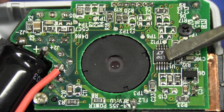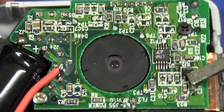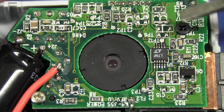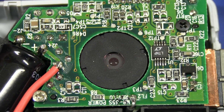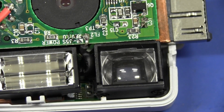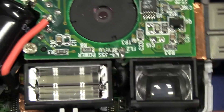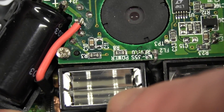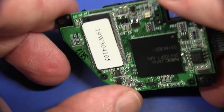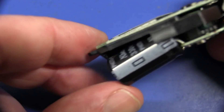The main board is pretty simplistic — that looks like a Linear Technology logo there. I don't actually know what the part is. We've got SOT23 devices, passives, and not much else in here at all. So we'll flip this over — here's the lens obviously for the CCD sensor, and we've got the viewfinder down here which is just a crappy bit of — probably not even glass, probably just plastic — and the flash in there with the reflector. I took off a couple of screws and looks like the whole kit and caboodle drops out. We've got some interesting stuff on the bottom here — clearly there's a second board down the bottom.